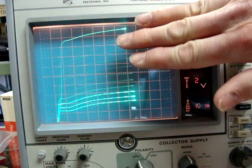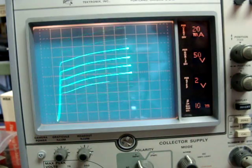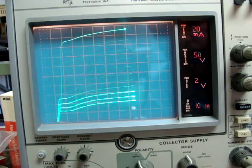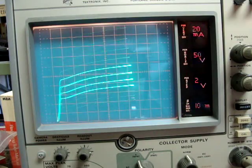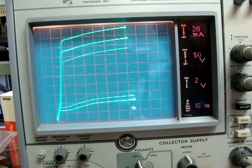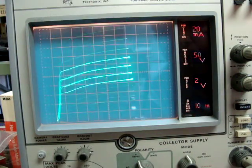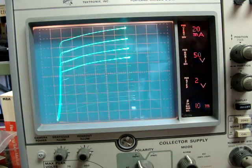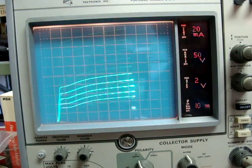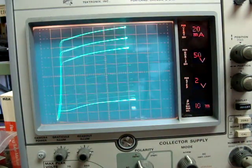You can see all of the negative grid biases from 0 down to minus 20 on the curve tracer at one time. That's what's important about testing tubes on a device such as this — you can get a more real-world comparison at 350 or even higher plate voltage. Something that other companies testing on tube testers alone absolutely cannot do. Buying a matched pair of tubes that haven't been tested at full plate voltage and accurate screen grid voltages won't tell you the truth about how well the tubes are matched. Give us a call — audiotubes.com on the web, 847-496-4546. We'd like to match a set of tubes for you.